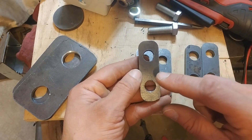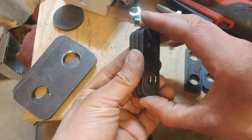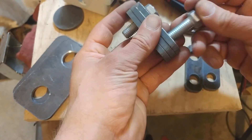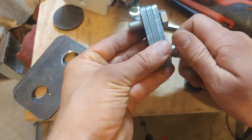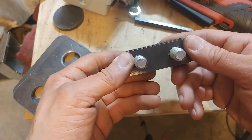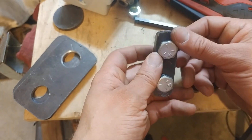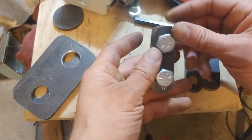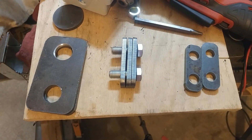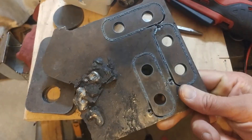These holes I did oversized just a little bit to make it easier to fit a half-inch bolt, and with a quick touch-up from one of those tapered drill bits, the bolts can indeed fit. There's a bit of difference between each one, but overall that isn't half bad. Probably one of the worst parts is the entry and exit wound where the torch came in. So with that wonkiness in FreeCAD, I decided to give Inkscape a shot for making the G-code.